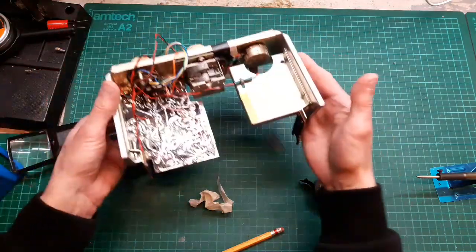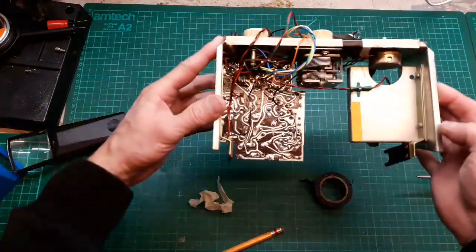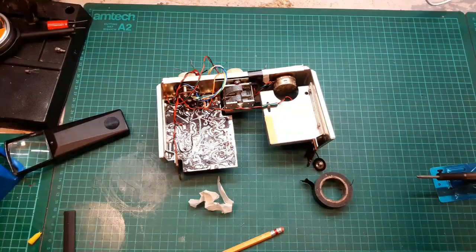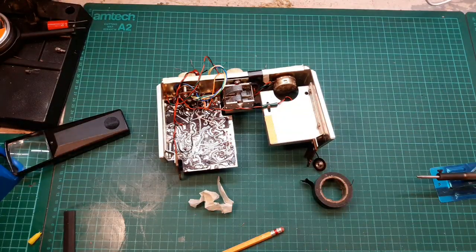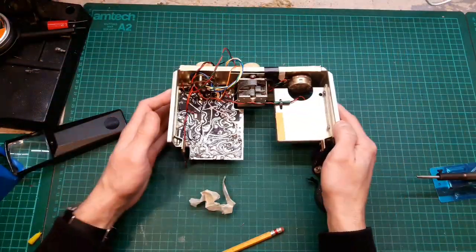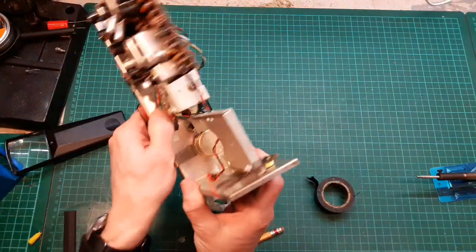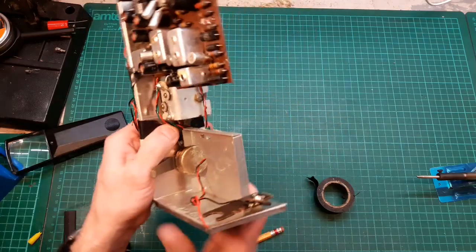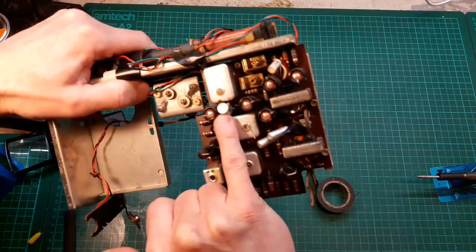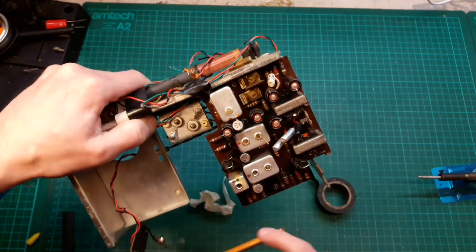Right, so there we go. That makes that board now. As you can see, let's get a bit more light on. Is that better? Just got another light. As you can see, that board now is a lot more open and free to work on. So what I'm going to do is re-stick that down, it's coming off again, and start in this area to get at this one under here, because that looks the trickiest. While we're at it, we might as well zap that AF117.